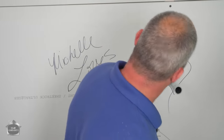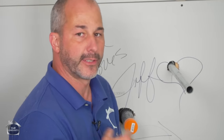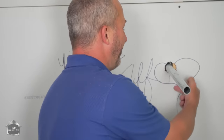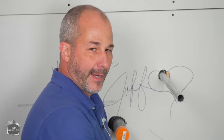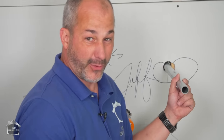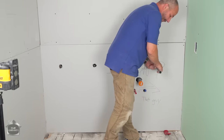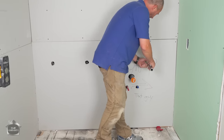Okay, there we go. Now this area around here is real easy to fill up. When we pull out the drywall mud, I'll just use a little bit of quick set compound, maybe just a little bit of mesh. We'll clean it up naturally. There is no natural flange cover that goes over these that's attractive, so we're just going to try to create a nice clean paint edge the best we can. Move this out of the way for now so we don't get an accident.